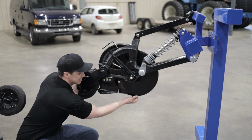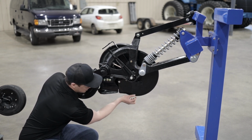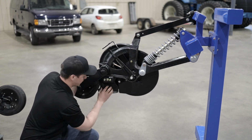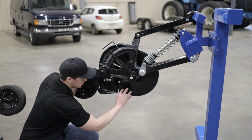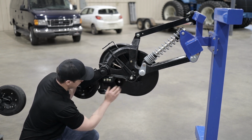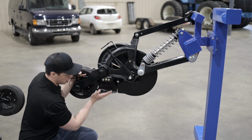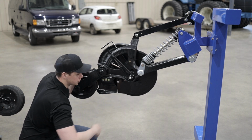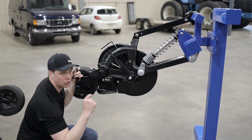Now, as this disc starts to wear, the relationship between the fertilizer and the seed will start to get smaller because the disc is getting smaller. So the scraper and the opener are both adjustable. This is a slotted scraper, so you can loosen this off and change the opener, change the scraper. The opener can be loosened off as well, and you can change the position of the opener to raise and lower it as well. So as this disc starts to wear, you may have to change that relationship so that your fertilizer and your seed are still at optimum distance at 3/4 of an inch.